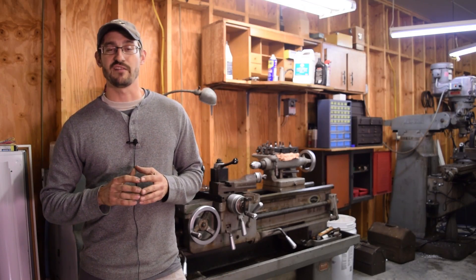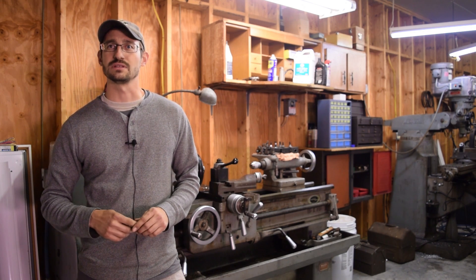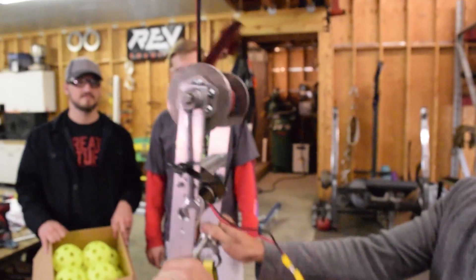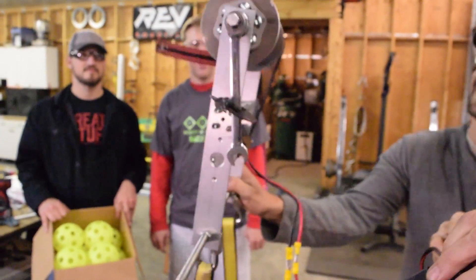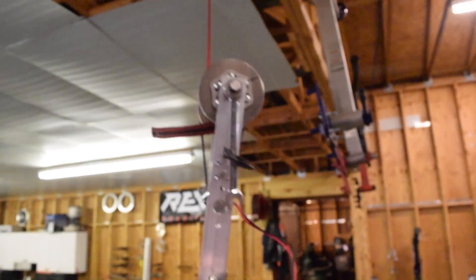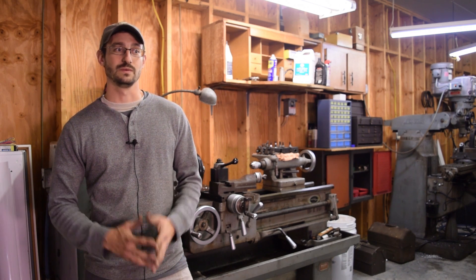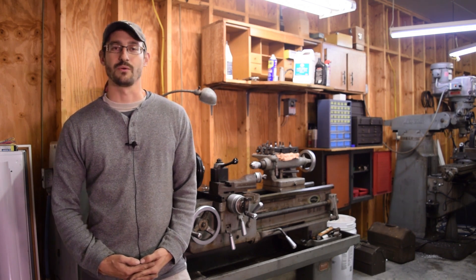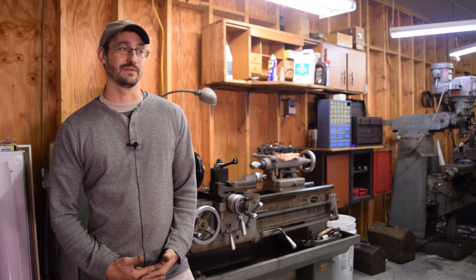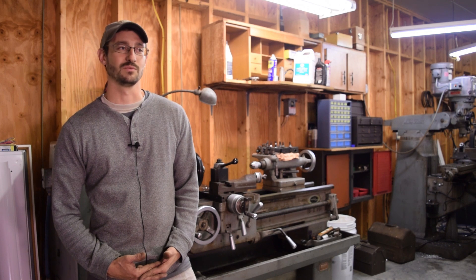The mechanism will mount on top of the robot and lay forward. When it hits the rope it'll start to wind it up, stand up straight in the middle of the robot, and lift from there. You may want to use a ratcheting wrench of some sort to keep it from back-driving. After our initial test, we lifted 95 pounds on a big barbell and it consistently lifted pretty effortlessly without pulling very much amperage. We're pretty happy with it and think it's a solid mechanism. Velcro is probably the easiest solution to grabbing the rope — it seemed to work really, really well.